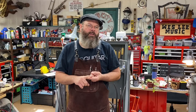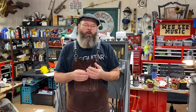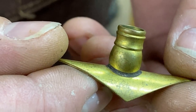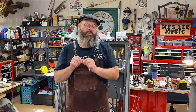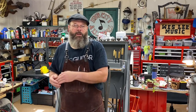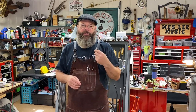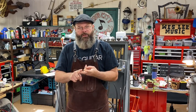Soldering can be broken down into two basic types. There's soft soldering, which is the braces to the instrument, for example, or silver soldering or brazing, which is the way that braces are made. So if a socket's brazed onto a flange and then it's soft soldered to the horn. Okay, so we're going to talk about that. And then within soft soldering, you've got low temperature silver soldering. So today we're going to discuss soft soldering, two types, 60-40 or 50-50 soft soldering and low temperature silver soldering.